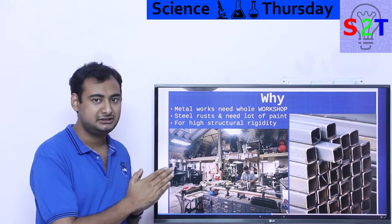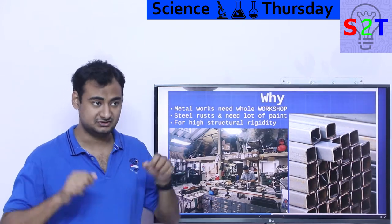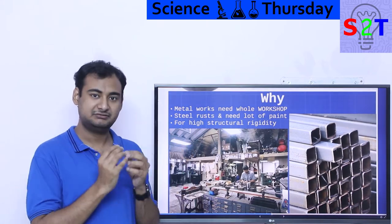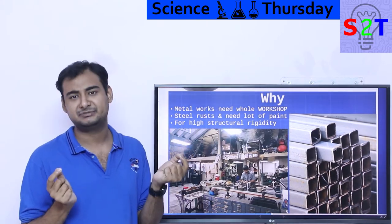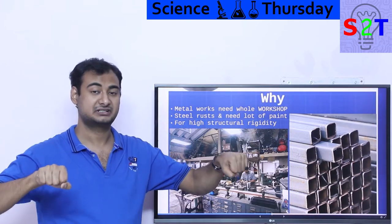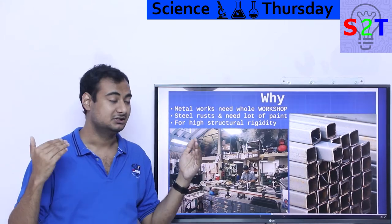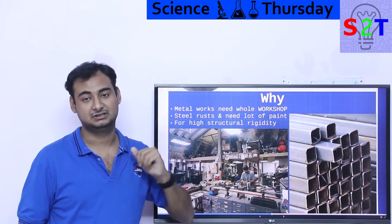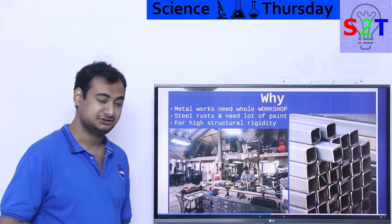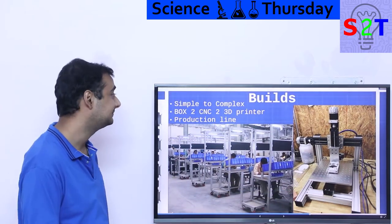2020 aluminum extrusions were designed with a profile specifically selected for the minimum amount of material consumed — so it doesn't become too heavy — but with the maximum amount of rigidity. To twist a piece that's only two centimeters by two centimeters and ten centimeters long, you'll be surprised how much energy it takes. It's not indestructible — not made of adamantium — but it's surprisingly good compared to steel box tubes.